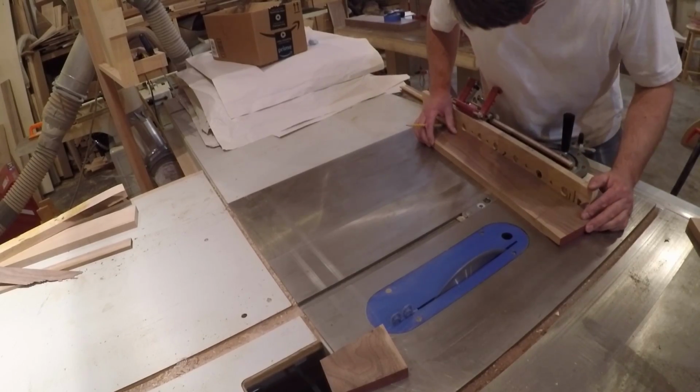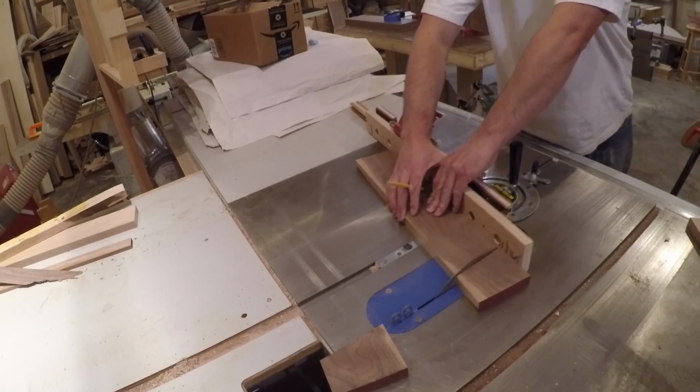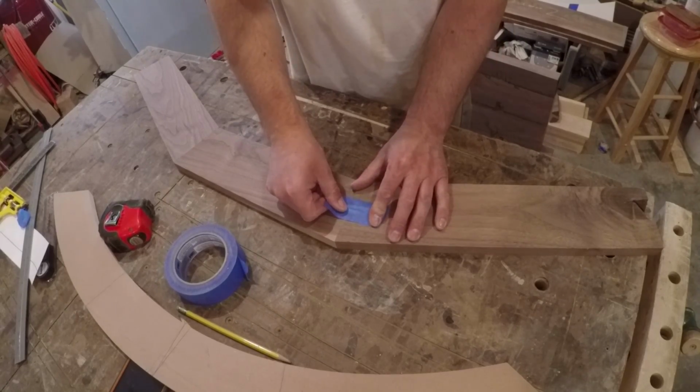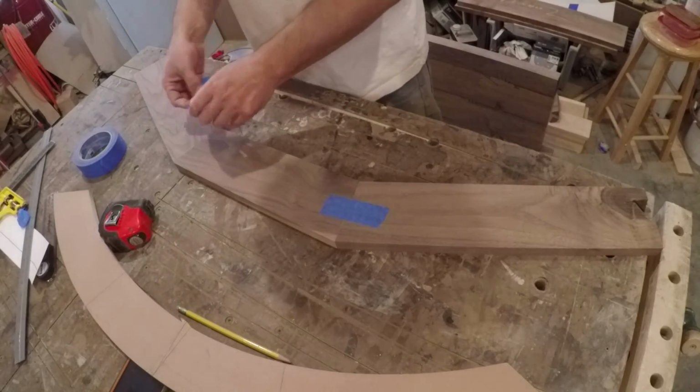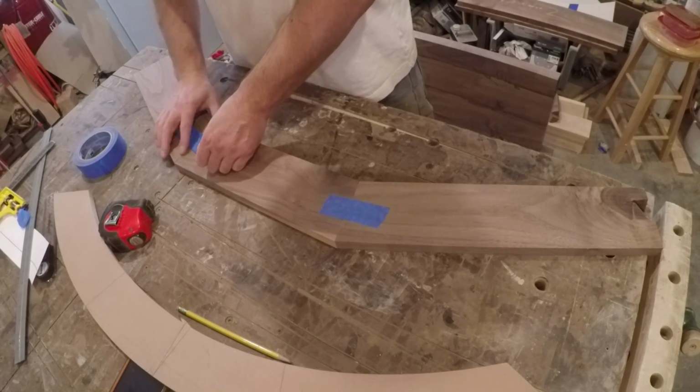If I would have cut the arch out of one piece of wood, it would have needed to be made out of a really wide piece, so instead I built it out of segments. As I put the segments together, I paid attention to grain direction so it would look like the grain flowed across the top of the arch. And before cutting the joinery, I did a test fit to be sure I had the right general shape.